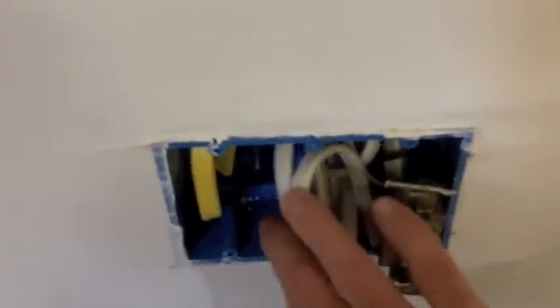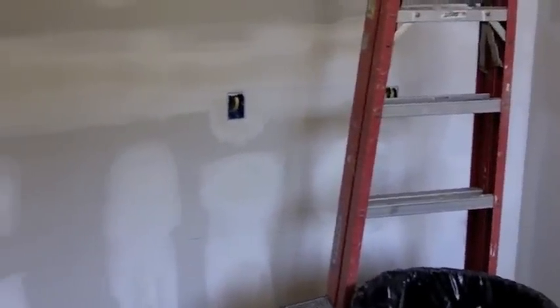They would have allowed it anyway, but it's just a good idea to keep your lighting circuit separate from a high-consumption appliance circuit. So I have only those two plugs on the under-cabinet lights, and now the under-cabinet lights run off the old knob-and-tube wiring. They're considered energy-efficient low-consumption lighting, so it's not that heavy a load.